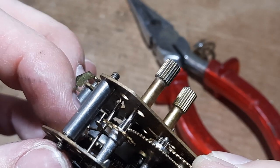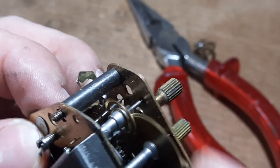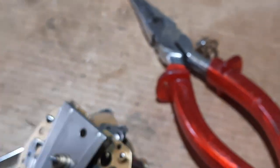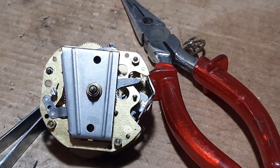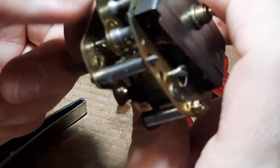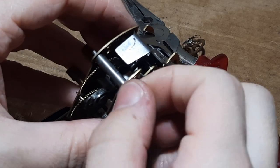The trick is you're going to hold this in a position where it'll turn freely without touching those two pins - that will also work. To be honest I don't think there's much power left in the spring at all, but it's good practice to try and let the power out of the mainspring. Because if you think about it - being fully wound up, the spring is going to have enough power to turn this around at least 24 times, probably about 30. And if that one is turning around 30 times, this one is going to be many many more than that - probably enough power to turn this thing thousands of times over a day. Letting all that go at once is quite unsafe. But now the power's out, I will undo the rest of the nuts.